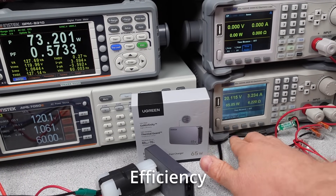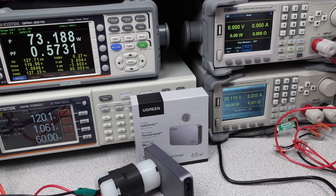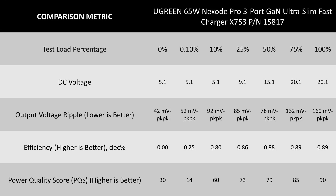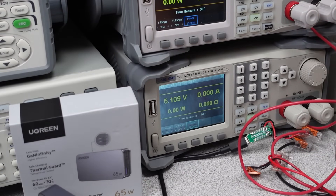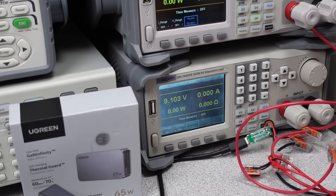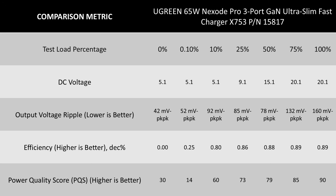The hint was already on screen a while back, but here it is with more detail. The adapter is a little too low on energy efficiency — across the board it just never gets good, and this is the trade-off of the form factor. I have yet to find a slim adapter that accomplishes class-leading efficiency alongside the slim form factor. The good news: the DC voltage was very stable, accurate, and the ripple was low. So in terms of output voltage, this is actually a good charger. But in terms of AC-to-DC conversion performance — its primary job as a power supply — it is poor.